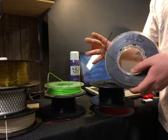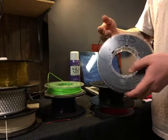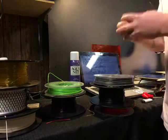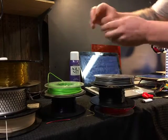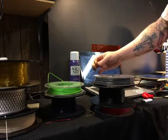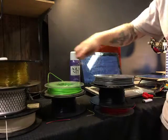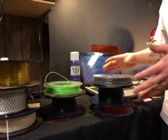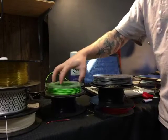Even though ABS isn't renewable, filament extruders have been developed for the home hobbyist. You can take your old prints, grind them up, put them in — it heats up a nozzle and an auger squeezes it through, melts it, and extrudes it at 1.75 or 3 millimeters, whatever you choose. Then you cool it, spool it, and you can reuse your old ABS. I believe that works for PLA too.